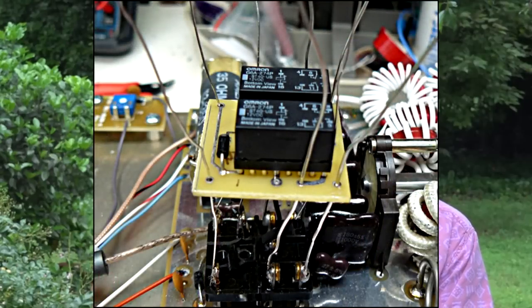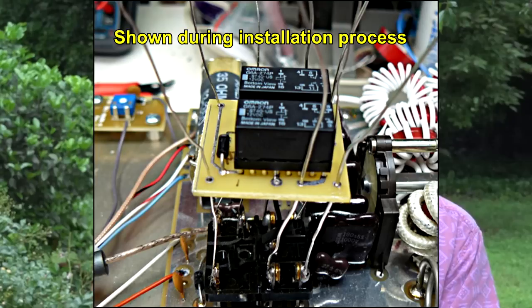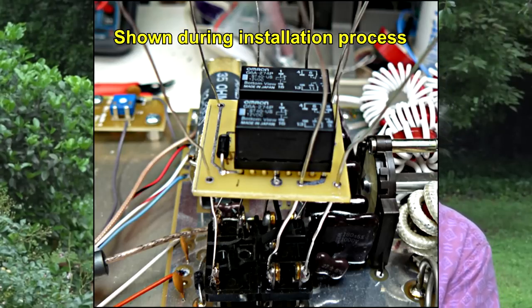There is an optional board on the market — I'm seeing callsigns like 85X and 85K attached to it. This fellow sells the board alone; you order the parts separately, which include a couple of very small sealed relays and some other small parts that mount on the board. Installation is not trivial, but not difficult. If you're a diehard high-speed CW op running 30-80 WPM, you might want to do this mod. I'm going to see how my relay operates over time and may install it later — but you do have that option to make this a real super-quiet, fast keyer.